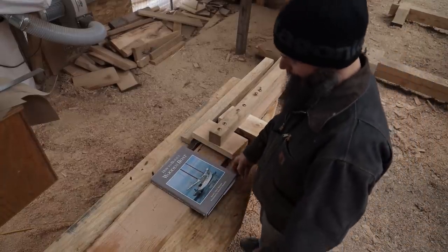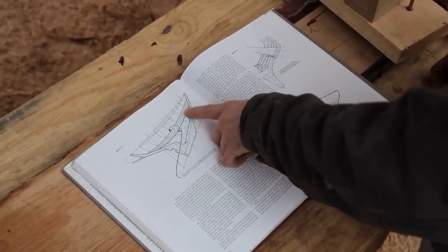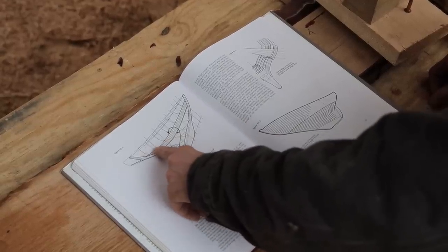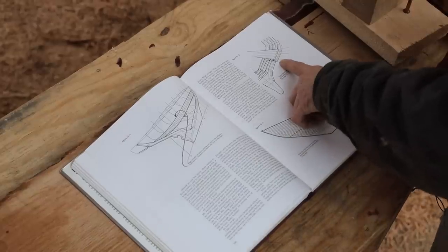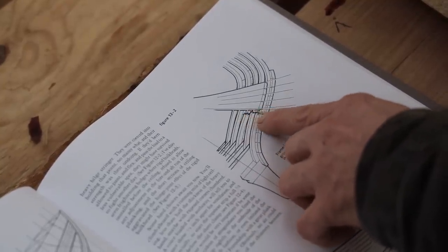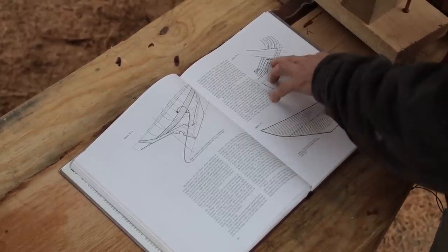This is our guiding light — 'How to Build a Wooden Boat' by Bud McIntosh. I cannot recommend this book enough. Looking at what Bud has to say about bilge bands, we can see that the bilge bands — also called bilge ceiling or bilge stringers — run from fore to aft on both sides of the boat, helping support that straight run below the turn at the waterline and above the turn of the bilge. One thing to be careful about is not creating too hard a spot. If you put in just a couple of really heavy ones, you can create a hard line and end up with frame breakage. So we're going to try to make the outer ones tapered and not make them crazy huge and super rigid.